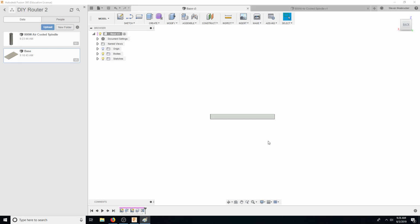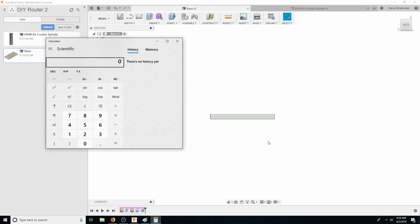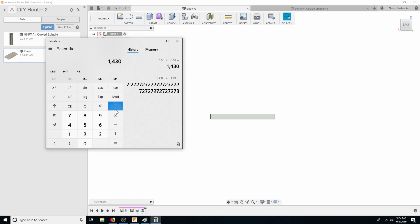Oh, and this is 220 volt. Oh, it asked you for 110 or 220, so I'd probably just run 110. I mean, it's 800 watts. 800 watts divided by 110 is 7 amps. It's not going to be as efficient because of 220. 220 is 6.5? What? Doesn't make any sense. That's 14. It's probably talking about at that efficiency, which is 0.6. Yeah, so it's about 0.56 efficiency at max horsepower, at max power.